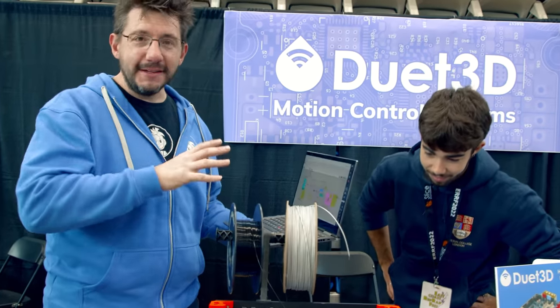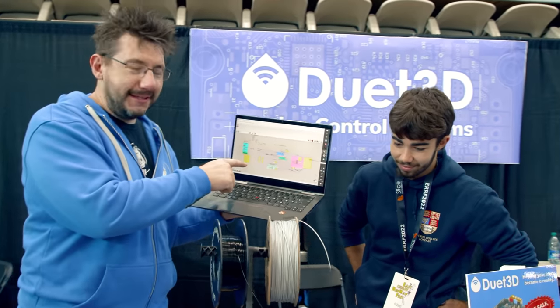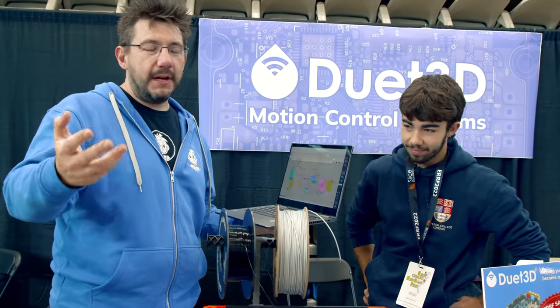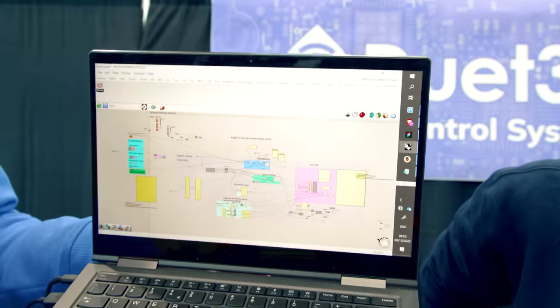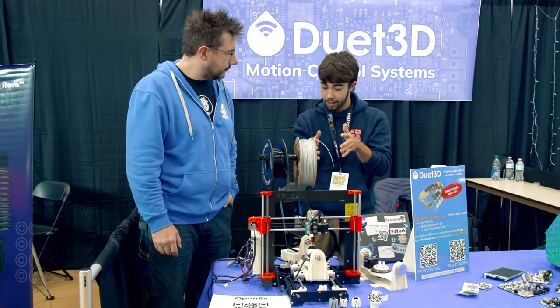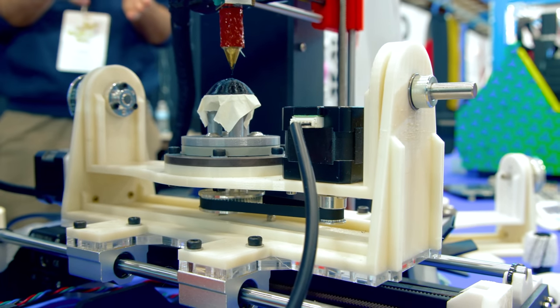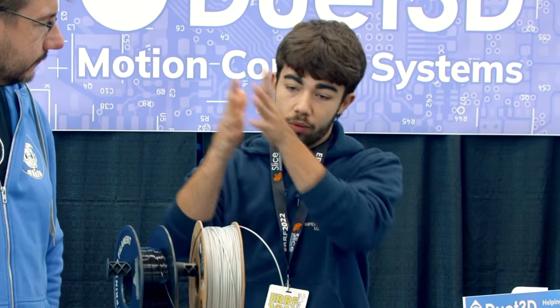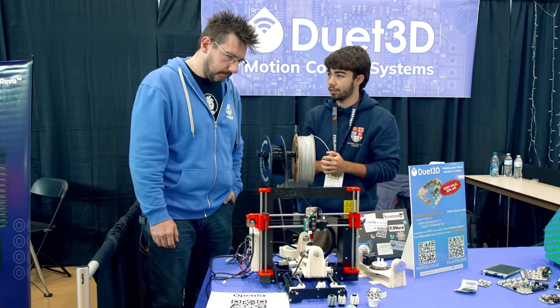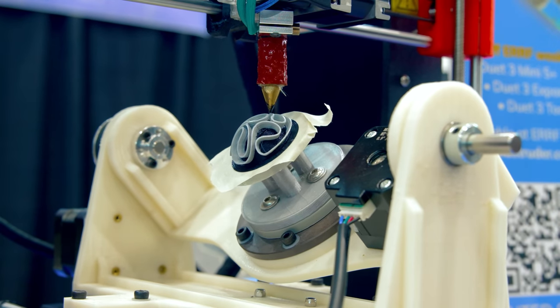Here's the slicer on the laptop — it's a Grasshopper script within Rhino, a huge definition of a lot of things. We compute all the kinematics; all the heavy work is done there. You basically take the normal of the surface relative to a point, compute the inverse kinematics to that, and that outputs two rotational values for the U and V axes, plus the X, Y, and Z. It's pretty crazy and quite computationally expensive.